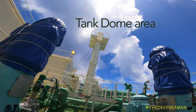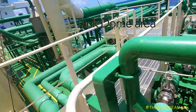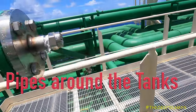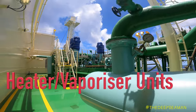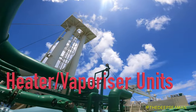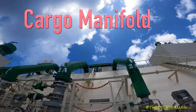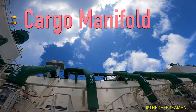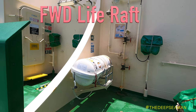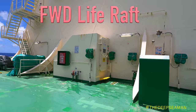The system is supposed to cover: exposed cargo tank domes, any part of exposed cargo tanks, booster pumps, heaters, regasification plants, components outside the compressor room, and exposed deck tanks — including pressurized storage vessels for cargo on deck. Also: any gas processing units, cargo liquid discharging and unloading connections, meaning the manifold area must be completely covered. All exposed ESD valves, liquid valves, vapor pipelines, master valves, any exposed boundary bulkheads, and superstructures like the accommodation front must be covered. Exposed life rafts, lifeboat stations facing the cargo area regardless of distance, and any semi-enclosed machinery spaces — such as a booster pump with a partial cover — must also be covered.